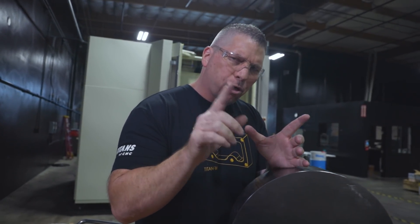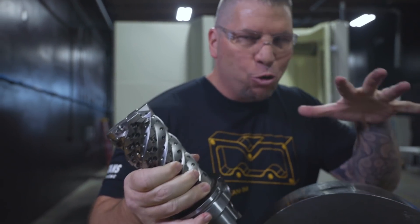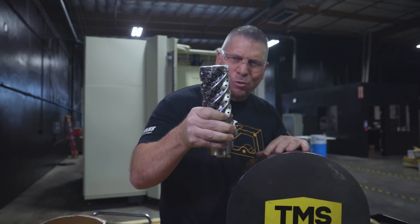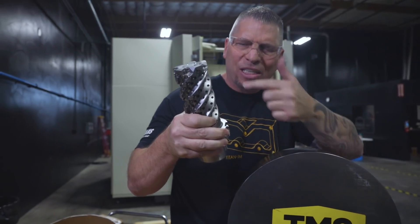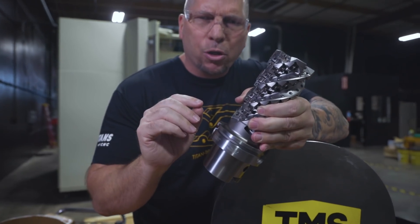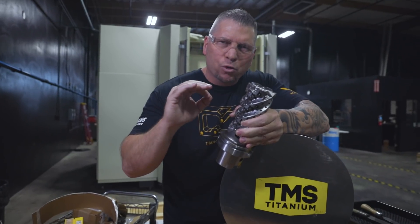Then we're going to come back with the famous Harvey 3, get into the corner, step it up, get it ready for multi-axis surfacing. Then we'll come in with a six-flute Harvey ball end mill, surface it perfect, and make the part complete to spec. Now you have the material, you've got one of the cutters — but how do you hold a big round piece of material? On the Makino we have more cutters, but this one is absolutely beautiful and insane. This is the type of cutter you use at Boeing when you're doing massive pieces.